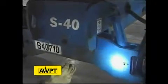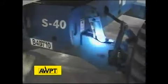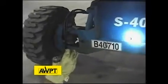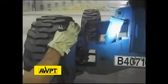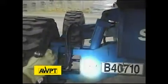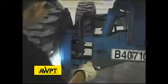Looking at the axle oscillate cylinders for damage, leaks, and other missing or worn parts. Fasteners that hold the cylinder in place, we're looking for that. Looking for the axle oscillate pin to make sure that it's secure and in working order. Again, we have another hydraulic cylinder looking for the same thing. Leaks, missing parts, damaged parts, things that the machine might have obstructed at some point in time. Other fasteners, another drive motor, hose assemblies, leaks inside the drive motor assembly.